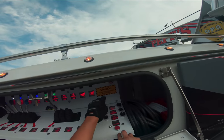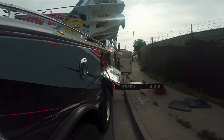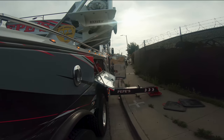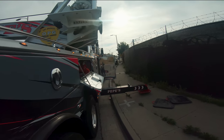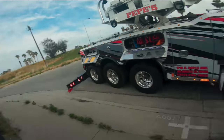Driver said 45,000 pounds — I'm going to need my outriggers extended. I'm setting up my outrigger pads. I've got two sizes: the one-inch thick and the two-inch thick ones for really heavy stuff. When I do something heavy off the side, I use the two-inch thick ones on the lifting side. To compensate for the unlevel ground, this one will contact first — but I can hold this button and this one and it tilts. It's got a five-degree tilt — doesn't sound like much but it makes a world of difference.